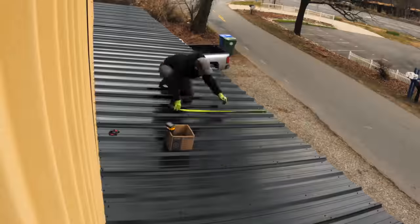I first cut the roof pitch angle — roughly 7 degrees in my case — on the side of the end of the trim closest to the building, and then brought the trim piece outside and set it in place on the roof. I marked out where the trim intersected the metal siding, which would need to be cut away to allow the gable trim to tuck up under the siding. After marking where I needed to cut, I got the section cut away using a small angle grinder. I got it cut and the trim fit well, with room for the in-wall trim to tuck in above the gable trim.